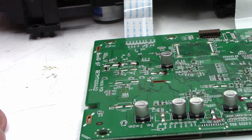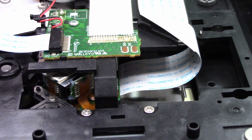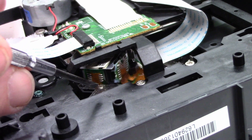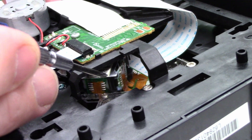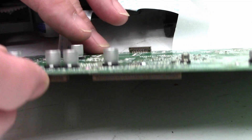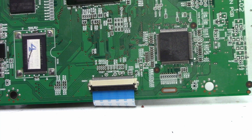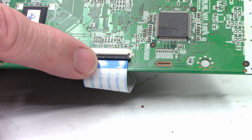As I specified in another video, I did not unplug this ribbon cable right here because this ribbon cable is what actually connects to the optical pickup. Right here is the laser diode, and on this side this is the receiver. I didn't disconnect that ribbon cable because the circuit board has basic anti-static properties built into it — it has capacitors across the laser diode — and I just don't want to introduce any stray ESD charges. I always try to leave this connected, only disconnected under extreme circumstances.